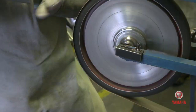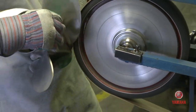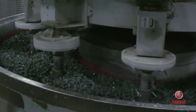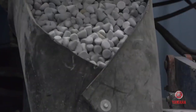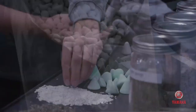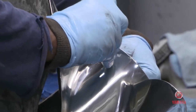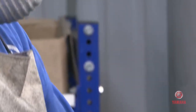All of this takes place to prepare the part and the surface for finishing, so we get that mirror finish. It's a three-step process. The first step is a stone ceramic with aluminum oxide in it. The second is a synthetic plastic. And the third is a corn cob that's treated. The final polishing step is a porcelain pin — essentially in there with just porcelain giving it that final polish.